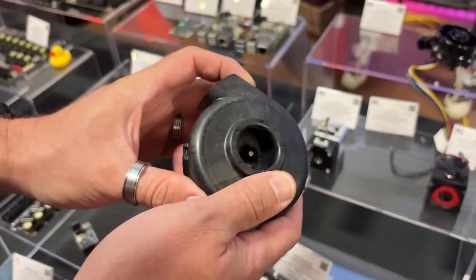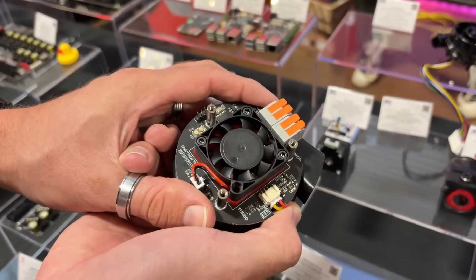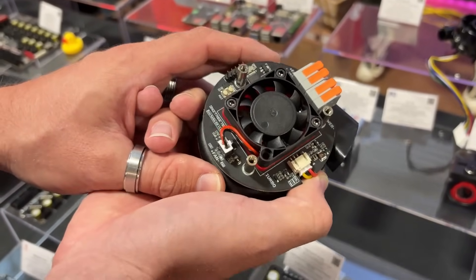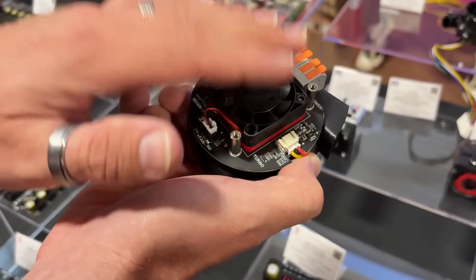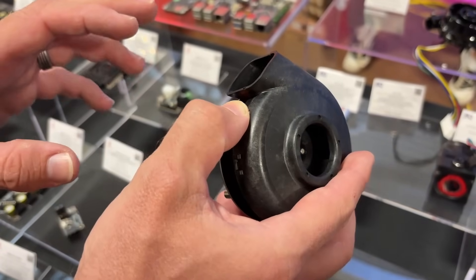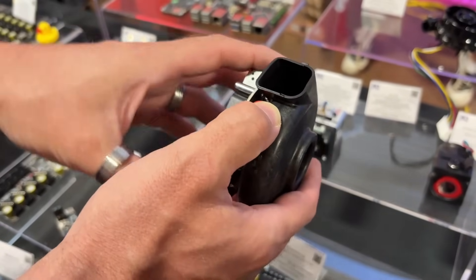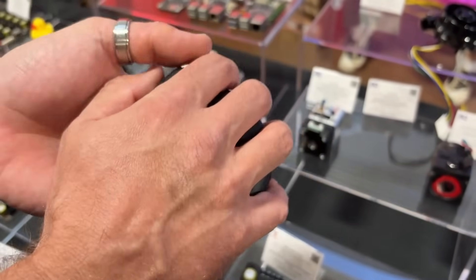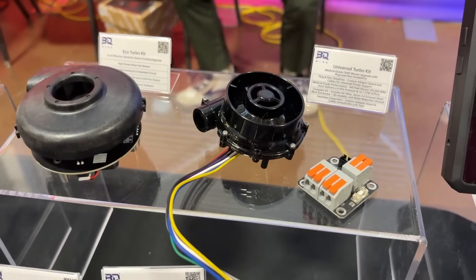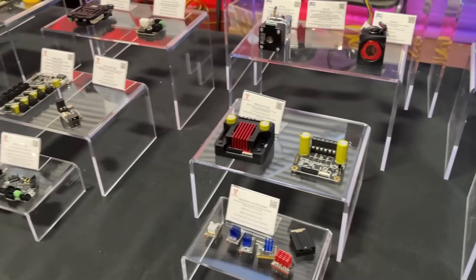The Eco Turbo is a robot vacuum fan repurposed as a remote cooling solution. To make it work we designed custom hardware, and since that hardware gets driven hard, we cool it with another fan — so this fan is cooling the fan. It's a really cost-effective blower solution that lets you take that weight off the tool head and use a CPAP tube to drive it. And then there's the big brother, the Universal Turbo, which uses a medical-grade CPAP blower fan.